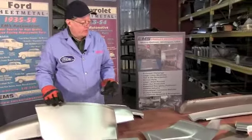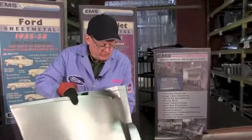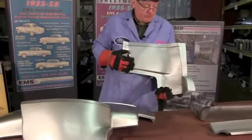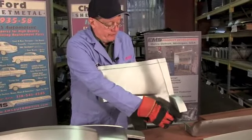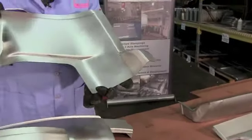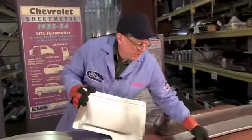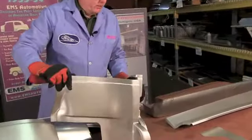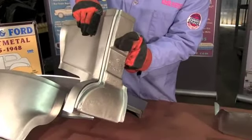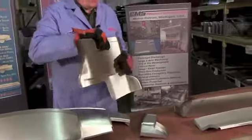As we move down the side of the car, we have the lower front cowl. This part will actually bolt up like that once the fenders are off. Most of this area is hidden by the fender, but here again we're getting into the very unique shape of the 41 Ford where we have this big horseshoe area that comes out. Stamped with no wrinkles, 18-gauge steel, with your offset. We include the doorpost in here, and the doorpost goes together so you're fixing up the lower part of the doorpost panel where the hinge pocket is — the lower front cowl.